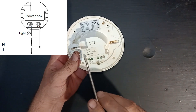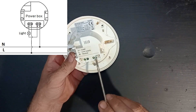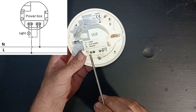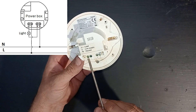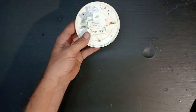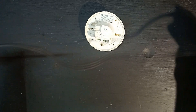As you can see, we've got the load live and the neutral. These two neutrals are connected internally just to make it easier to connect. Then you've got the live — that's the input — and then the live that's the load. This looks like a live with an eye but it's actually an arrow pointing out, so this is your output and this is your input.